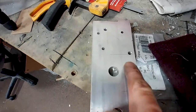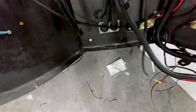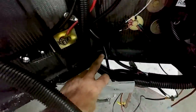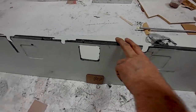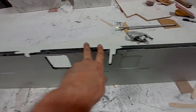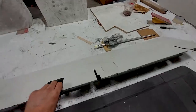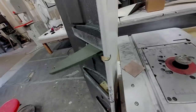I'm cutting out quarter-inch thick aluminum spacers — after we had the engine on we realized the firewall was too low, so we had to space out the engine mount from the firewall at the bottom. Jeff has cut the slots and little access panels in the lower elevator skins for both elevators, so they're almost ready to be bonded onto the upper skin and ribs. Getting close to finishing the elevator — after that, I just need to put in the pitot tube and the magnetometer and close out the tail plane.